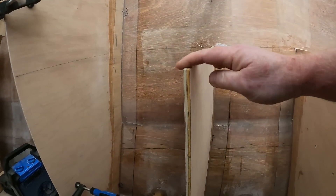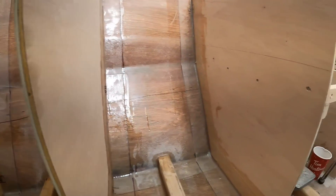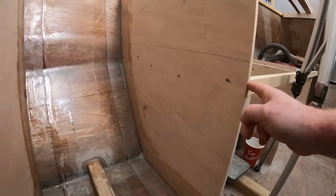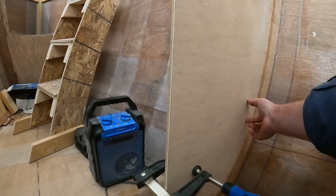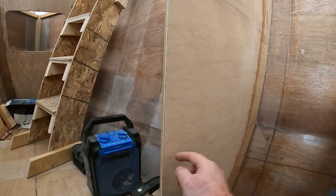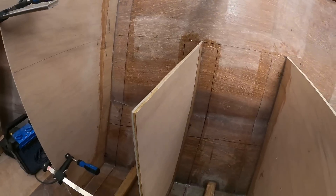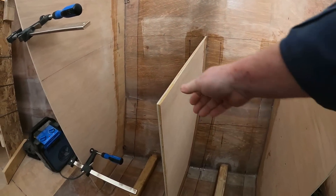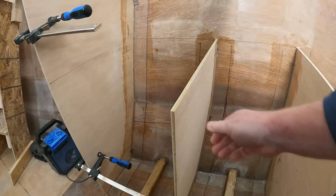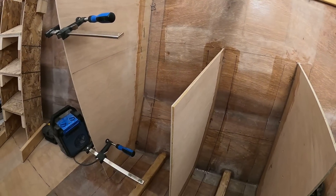The next thing I have to decide is how I'm going to attach a stringer. I'm going to want to carry on at this height straight across all of these. I think I'll do it the very same as before — I'll put a cleat coming out like this, notch the top, and then connect a stringer right across. I'll do the same at the top right across here. That'll strengthen all three of these, and I'll make sure I center them as well and really lock them into position. Time to take those measurements and get started.